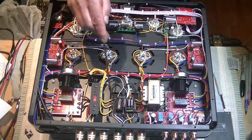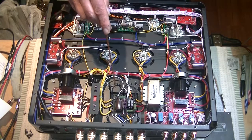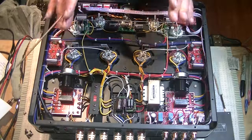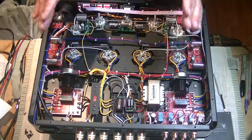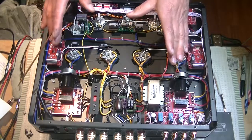So here's your power transformer. It sits on the top of the amplifier, nestled in the middle, and it's going to take our household voltage and step it up to whatever voltage we need to rectify to DC. So it could be somewhere around 375, 400 volts. I didn't actually check to see what it is, but it'll be a much higher voltage.